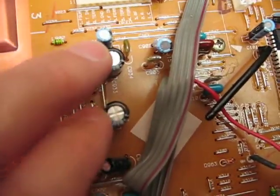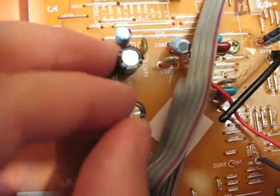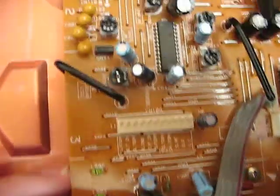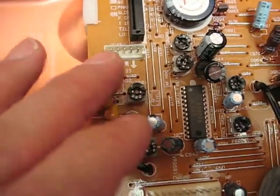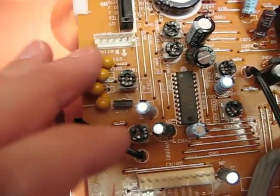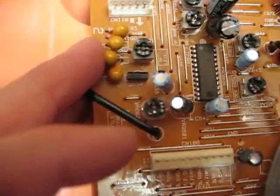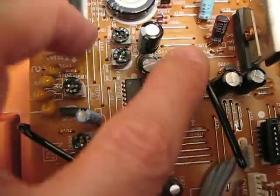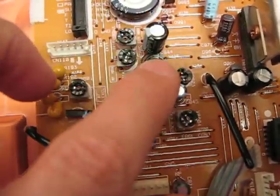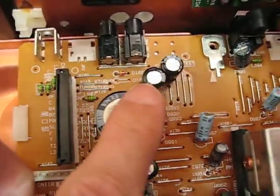These are 10 times bigger than the originals and high-quality electrolytic. Over here we've got a whole bunch of stacked up tantalums. This is all in the RF circuit — we want the RF to be nice and clean. That also has to do with these caps, which are also 10 times bigger than the originals.